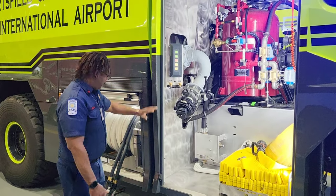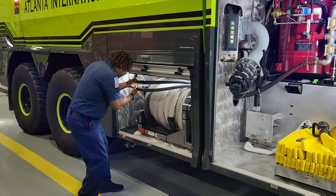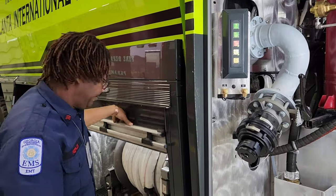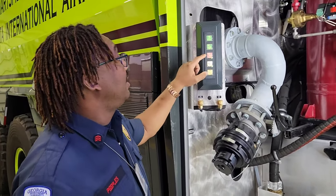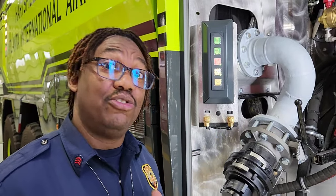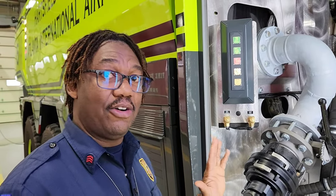There's no more hissing coming out of the nozzle — it's fine. We got all the pressure out of the tank, so now we can close this out. Put your hose back up and close the door down. This is very important: after you close the valve on the nozzle, your next step is to come here and turn off your hose reel and turn off your Purple K. Do not forget this step, because if you forget it, when you turn your bottle back on you're gonna charge that whole tank again — and you do not want to do that. You'll be back here for the next 30 minutes trying to get the pressure out of that tank. So turn off your hose reel, turn off your Purple K.